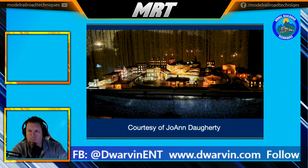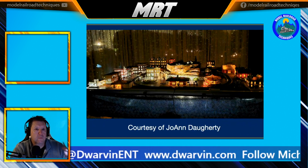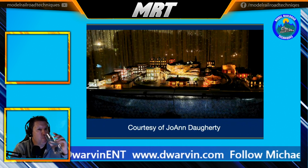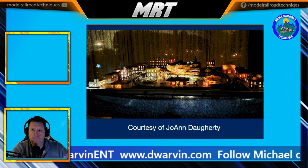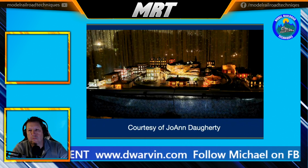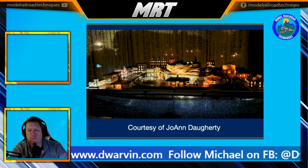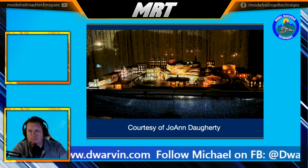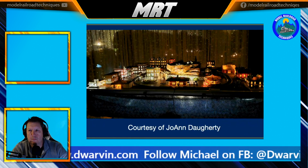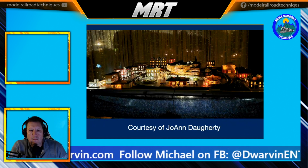And once the light gets into the fibre, because of the difference in optical density between the fibre and the air surrounding it, the light actually stays in the fibre. So it will go around bends as well, because it just bounces back and forward along the fibre, bouncing off its walls. And as you say, Dazzy, it's only when you nick it, you damage the surface, and a small amount of light can escape, giving you these pinpoints of light.